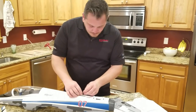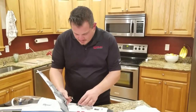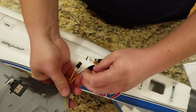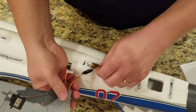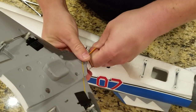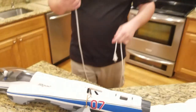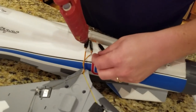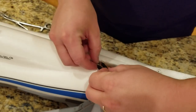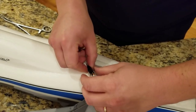You'll need to connect the plug before screwing things on. It doesn't matter which one goes to which, but you just need to make sure the brown goes to brown. They're keyed, so it's pretty easy - if you try to plug them in the wrong way you'll have a really hard time and will eventually damage stuff. One thing I've learned: have a hot glue gun hot, and you can put a little bit on the side that connects. You'll add a tiny bit of weight but you can tidy up your wires as you go.